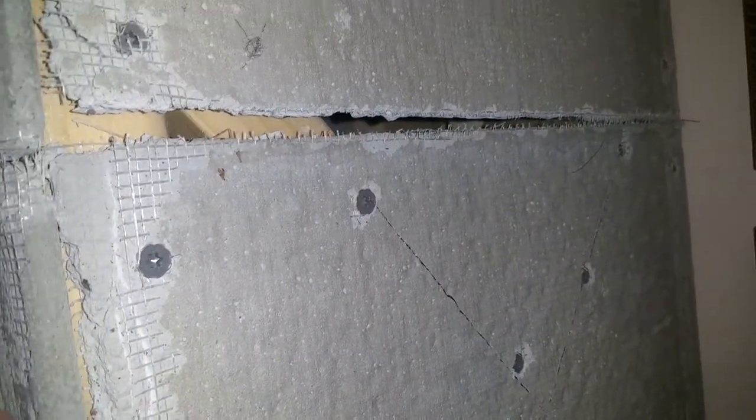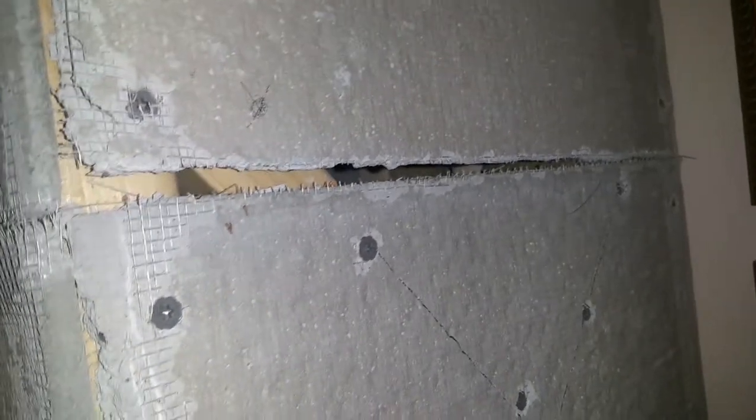And I did this side first, and I, for some reason, didn't pay attention to that, and I left it as that. Over here, you can see there's some big gaps. What I'm gonna do there is fill it with thin set first, and then I'm gonna put the mesh tape. So I'm just gonna put the mesh tape where I can right now. Gaps like that, that's fine. And notice what I did was this one has an edge guard. I put the edge guard out so it would help me even a little bit more.